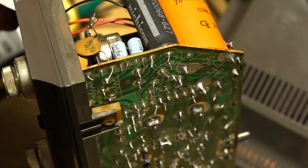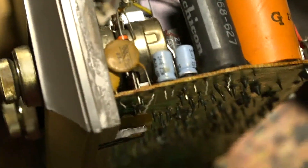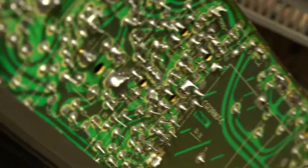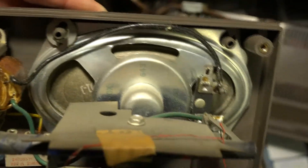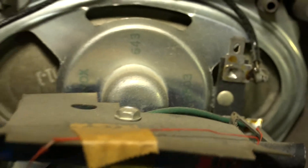Here's another look at the underside of the PC board. I was starting to notice some interesting things about this radio. Look at the lead off of this disc capacitor — it's quite lengthy. There are some other connections on the board that I didn't find any shorts on, but they are bridged. Overall, it's a very hurried-looking soldering job. Also, in 1966 you've got Nichicon capacitors in this thing, so they were already sourcing parts globally. The speaker is of course Magnavox-branded — Magnavox started as a speaker company — though they may have been putting their name on someone else's speaker.